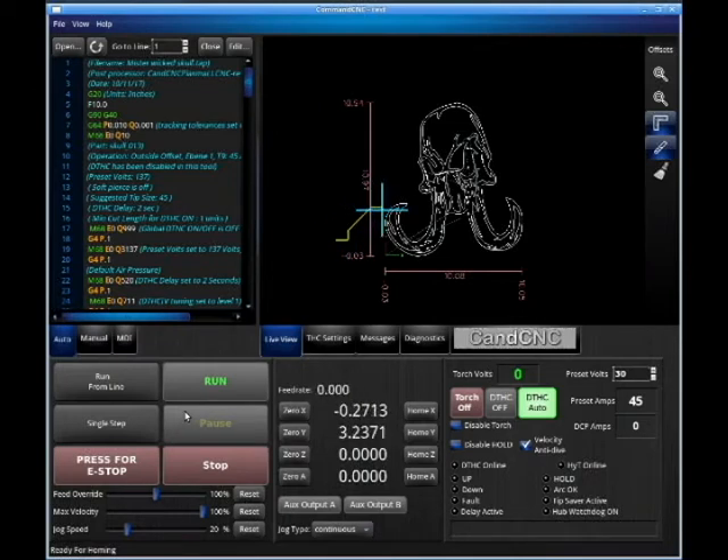The cable's moving. If this screen doesn't come up and gives you an error, either the control is not turned on fully, or your cable going to the control is in the wrong spot — hopefully it isn't, that can cause some problems — or it's broken. This screen coming up is your guarantee that you are connecting to the controller and the PC is happy.